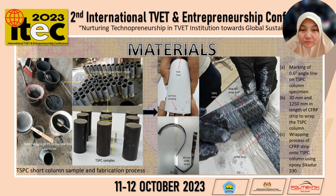This is the process of test sample preparation. Figure A was marking of 0.6 degree angle line on the TSPC column specimen. Figure B indicates a 30 mm wide and 1250 mm long CFRP strip to wrap the TSPC column. And figure C was the wrapping process of the CFRP strip onto the TSPC column using epoxy Sikadur 330.